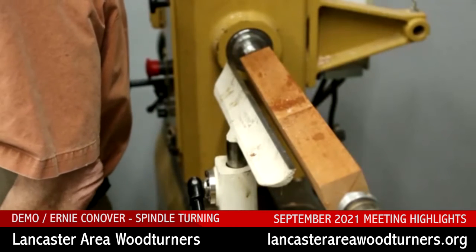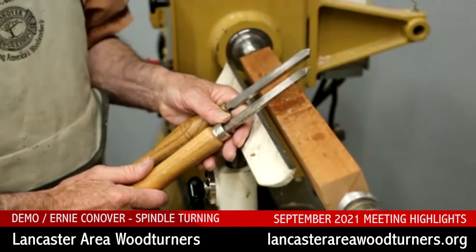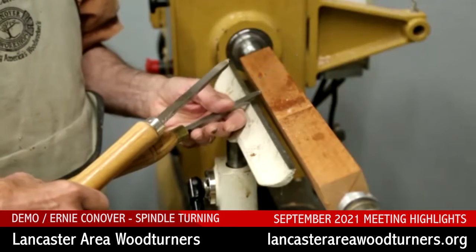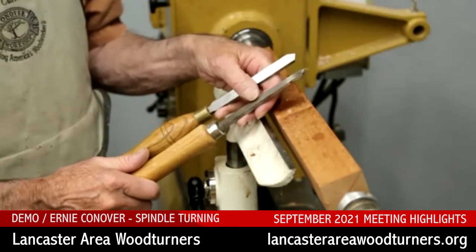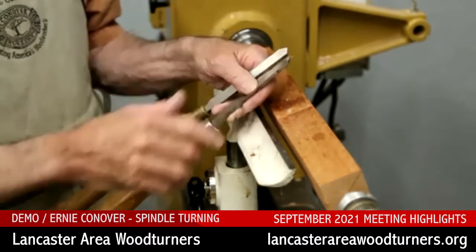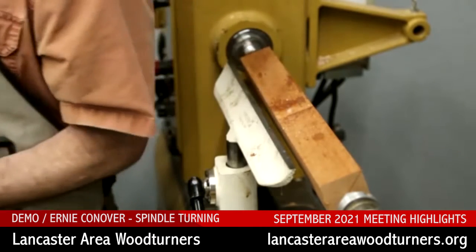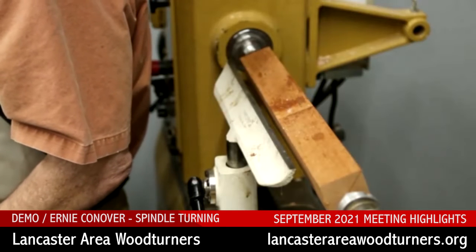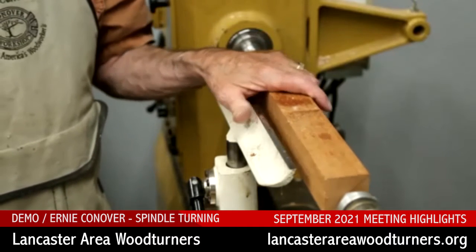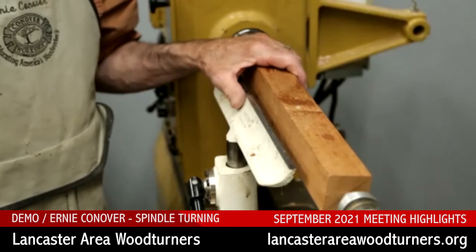And then you have the scrapers. For spindle turning, I mostly just use these V scrapers. And I do everything from undercutting an edge, getting a square shoulder, you name it. And I grind them this way and that with different angles in them with the needs of the job. Scrapers are what I call an ephemeral tool, and you use them up and grind them up and buy new ones. They're what accountants in a machine tool business used to call perishable tooling.